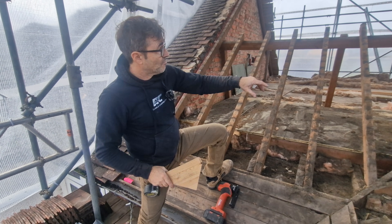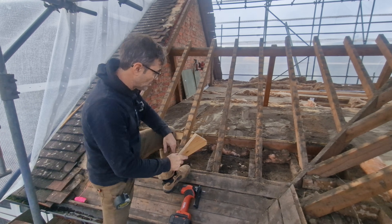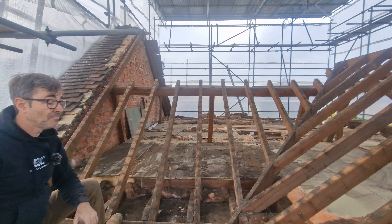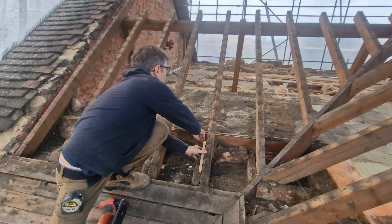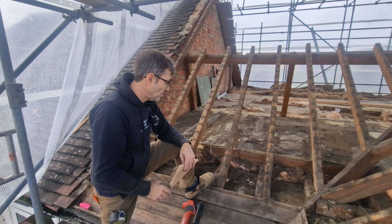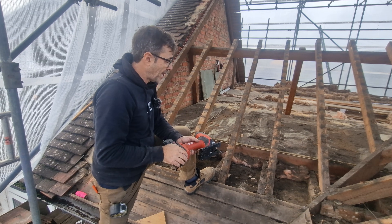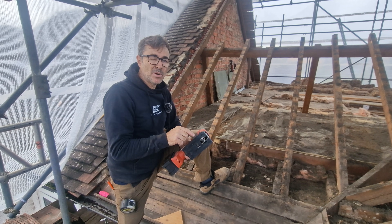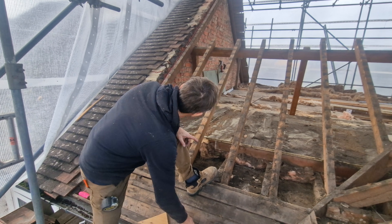Before I take the small front section out, I'm leaving this bit at the front — it stays. Here we've got new rafters which will start from the wall plate and go all the way up to a steel running through the top. To cut these off I'm rough cutting them for now using a little template to mark them, and I'll tidy them up as I'm going to join them with noggins back to some of the new roof. I'm using a jigsaw because it's compact and versatile. Unlike a circular saw, if the blade binds it'll just stop rather than kick.